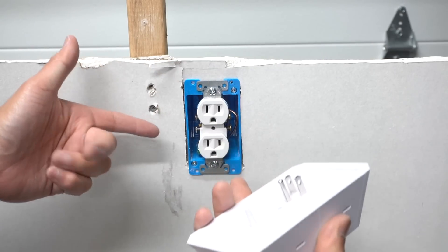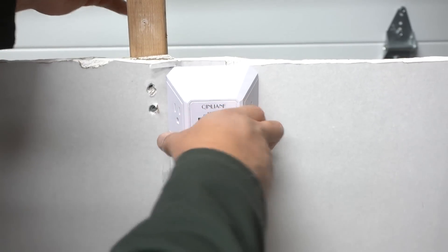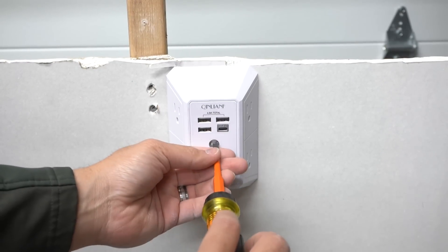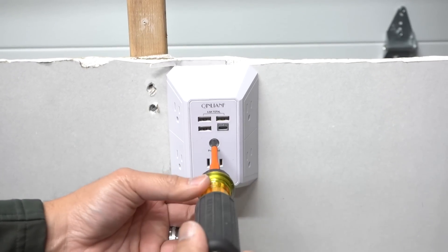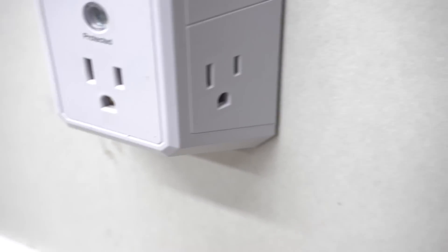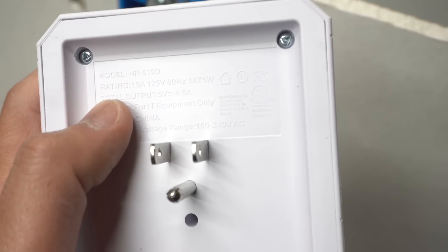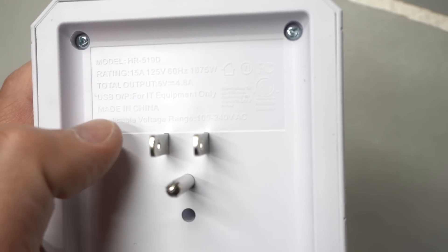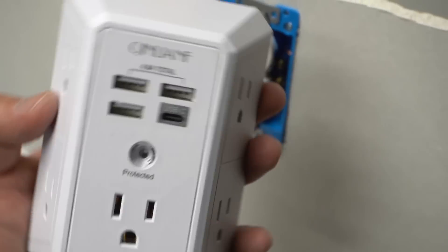Be very careful — don't touch the inside of the outlet. Turn off the power from your circuit breaker just to be safe. Insert it like this, and with the given long screw, screw it right onto the middle of the outlet. There's a small gap at the edge, which is fine — it's much better than if you had a cover plate, which would create a bigger gap. The specs: rated for 15 amps, 125 volts, 60 Hz, 1875 watts, and it is UL standard certified. If you're interested, I'll leave the link in the description down below.